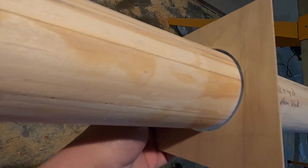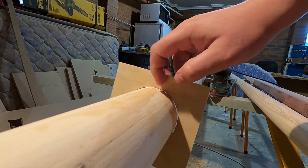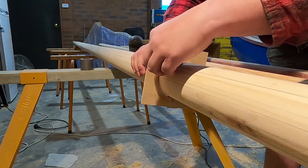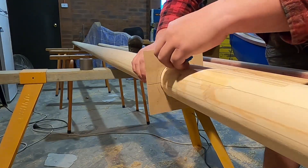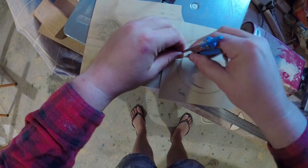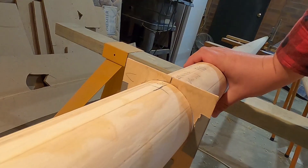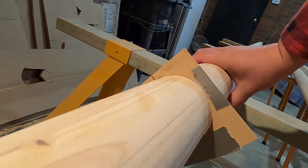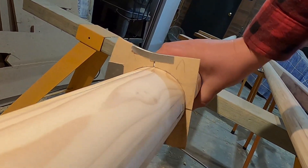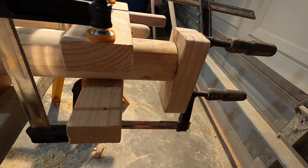I've cut an 80 millimeter section out of some thin plywood and I'm going to try and transfer the section onto this piece of wood. This ring should now be pretty much nine millimeters bigger than the mast. That seems like a pretty good approximation - there are a few little gaps but nothing too dramatic. This wacky arrangement here is how we're marking on the bottom block where the mast goes through.